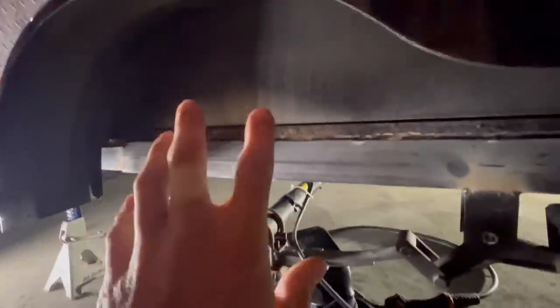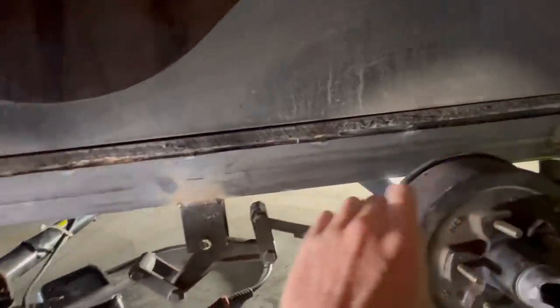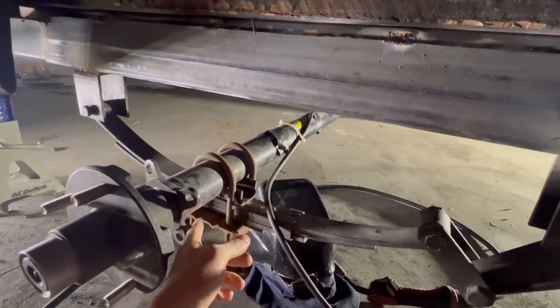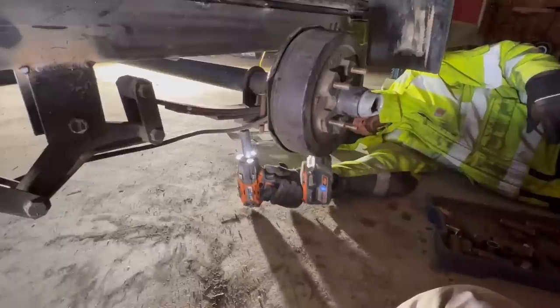All right, but we're basically done with the repair that we knew to do on this side. I just have a couple more welds to make, and then we're gonna break these off, and we're gonna go ahead and bevel out the cracks that we found on the axles, and we're gonna weld that out.